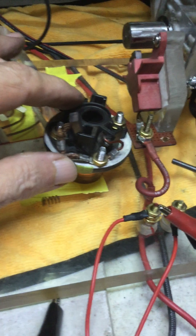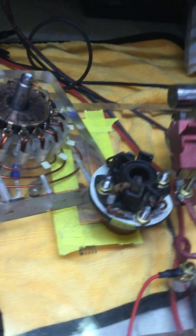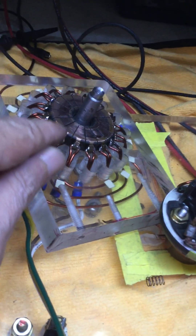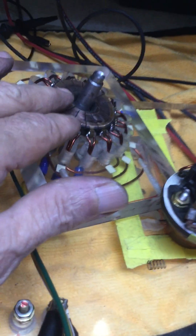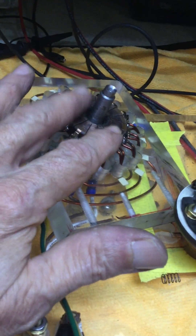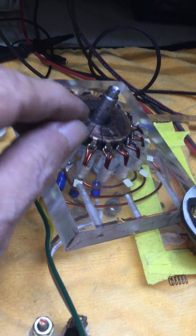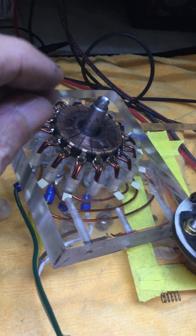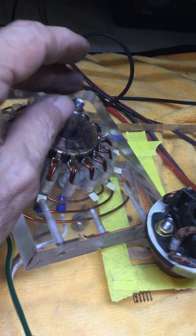This is not due to any arc or Tesla arc or some kind of magic — these are just contacts. If they don't make the right contacts, the field will collapse in the middle of a sequence, and that kills your output. I was having a 65-volt AC output and at certain points it was shimmering — the light was coming down and going to 50, 55, 58 volts, and it didn't go back up to 65.